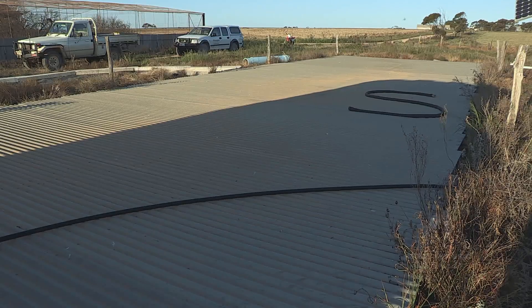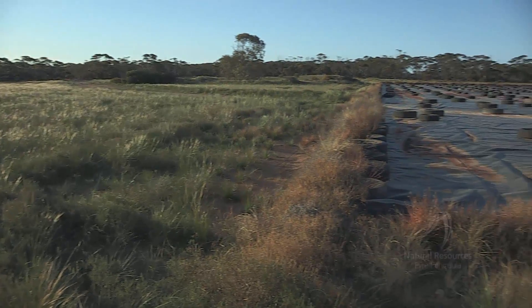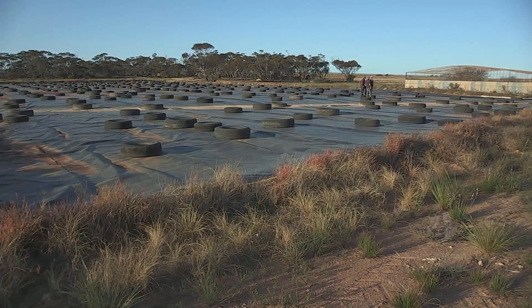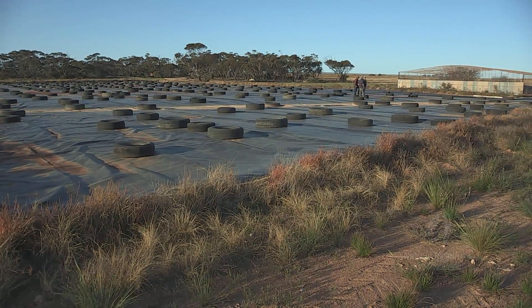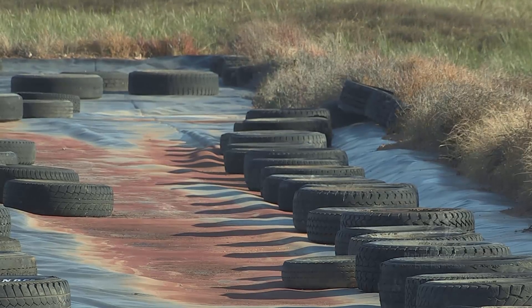We're located here probably because we had the big storage tank there in the first place and the underground tank, and it is in a flat where a couple of roads run into it and a couple of drains, so it was pretty easy to set up here. It looked a pretty level spot — we put a dumpy level in just to make sure we had a fall on it, and gouged the blade in to dig a trench on a couple of sides so we could just lay it in and windrow the dirt back on it.